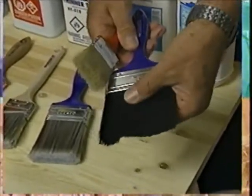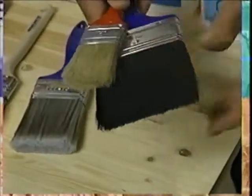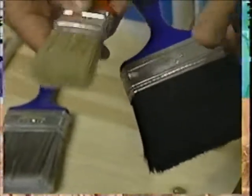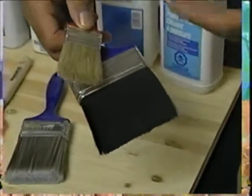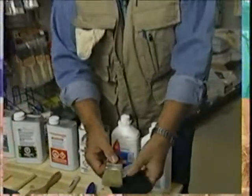In this particular case, being pure bristle — this one here could be horsehair, this one I believe is hogshair. All different projects, all different prices. If you buy a hogshair brush it's going to be less money than a horsehair brush, and there are many other types of pure bristles used. But why a pure bristle brush? The pure bristle brush is used for oil and alkyd paints — oil and alkyd.